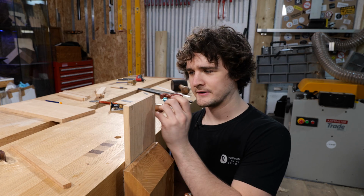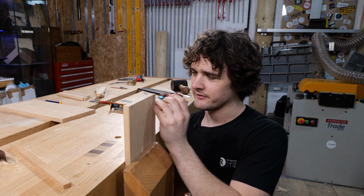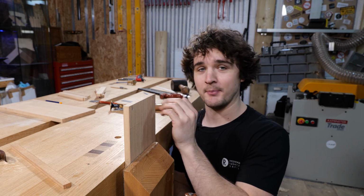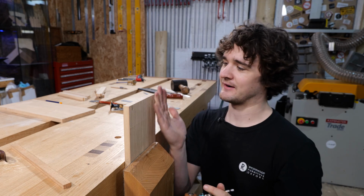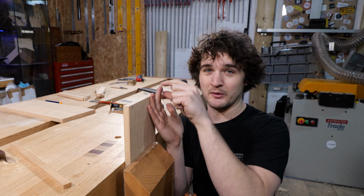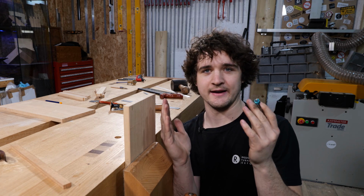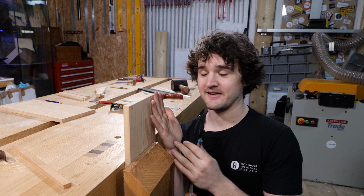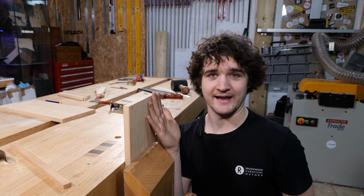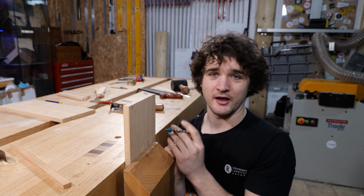And I've chosen to drill into the face of the wood as opposed to the end grain, because drilling into the face will create short grain above the drill bit, because the grain is traveling down like this. If we drill into the face of it like that, the area above it will easily break off. Whereas if you drill with the grain, yes, you're going to clear out some circles, but the grain that's left behind is still going to be attached at the baseline.